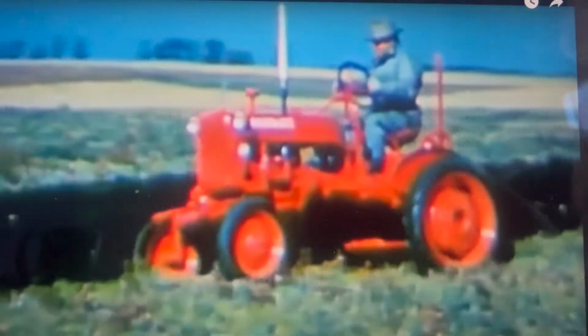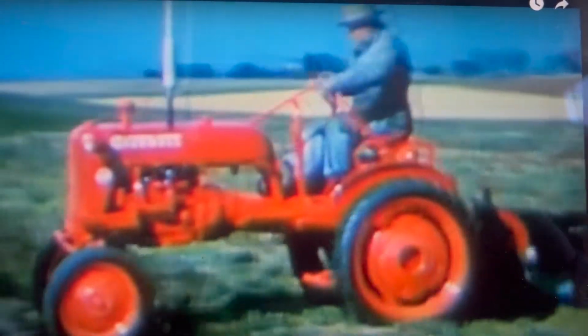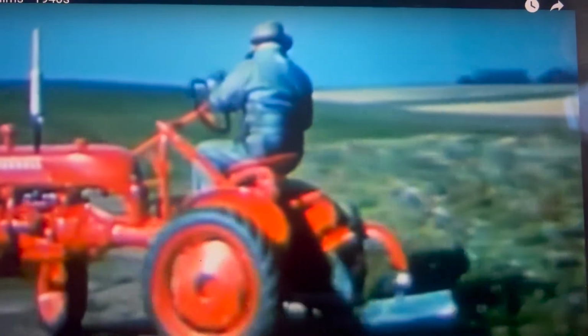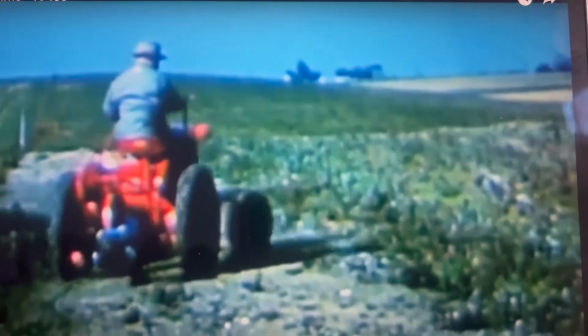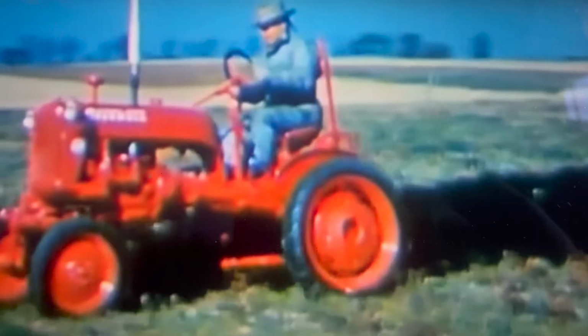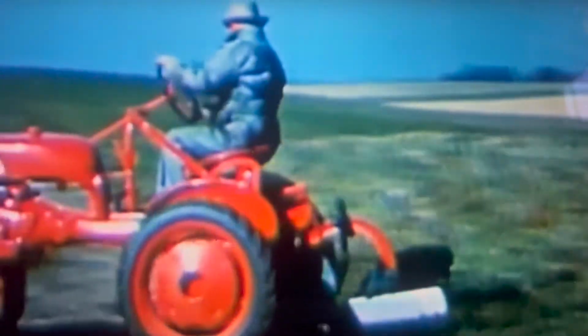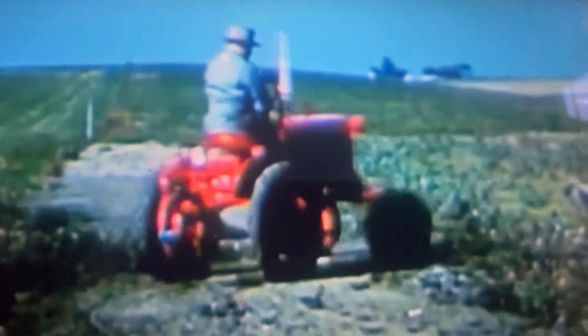The Farmall Cub's high-compression, precision-built four-cylinder engine delivers 8 horsepower on the drawbar. This ventilated engine has positive pressure lubrication, an efficient cooling system, and is economical on fuel. It filters the oil and filters the air. A master control lever raises and lowers the plow and other rear and front-mounted implements. A counterbalancing spring, which neutralizes the weight of the implement, makes operation easy and quick.